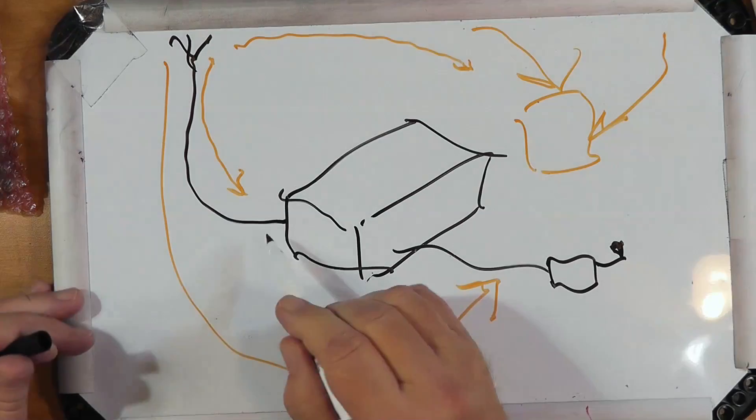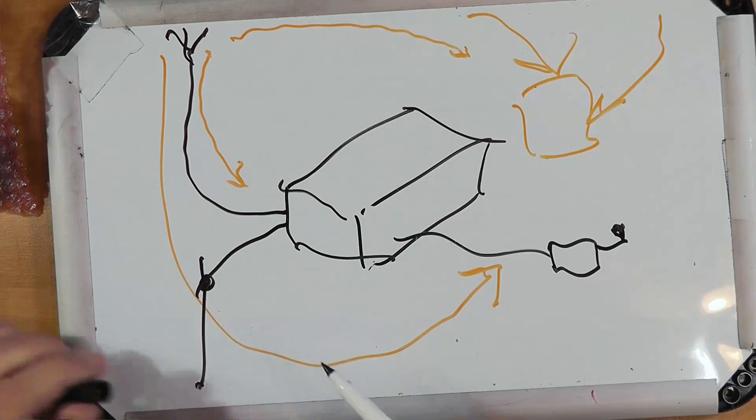So you're going to have to narrow down what you're going to use. I would suggest trying to move cables around. If you did something prior to this issue, undo it or redo it a different way — because it's just on one band and only above a certain power level. Make sure this thing is extremely well grounded; that will help a great deal. Your antennas should be grounded if you can — kind of hard to ground a dipole. Try running the radio on a 12-volt battery and see how well that works. If you get the same problem, it could be something coming in through the power supply.